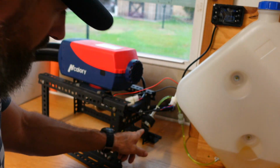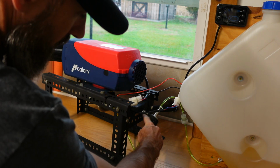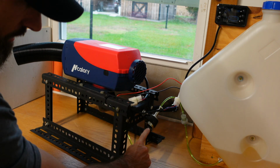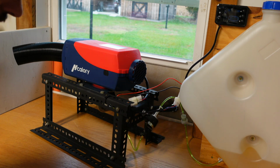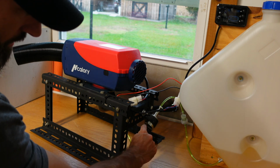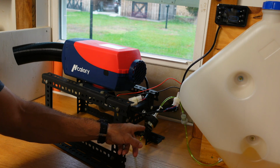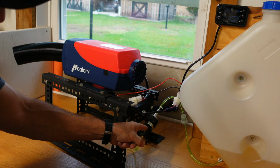And another thing I seen, if you see in my video here, my fuel pump is the wrong way. I'm going to loosen that up and spin that. I found out where the fuel comes out and goes into the burner, this part should be up. It should be on a 45 the other way, not the way I have it. So like this, where I connect the wires, the arrow, like my arrow is pointing down right now. That arrow should be pointing up, right around 30 degrees, or like 35 to 40, probably like 30 to 40 degrees.